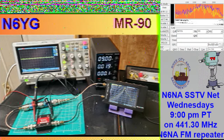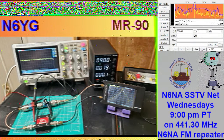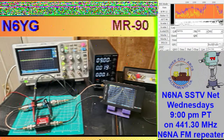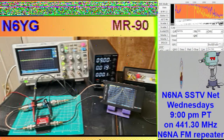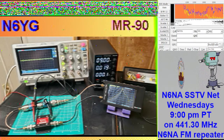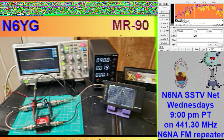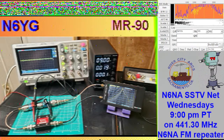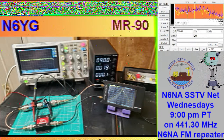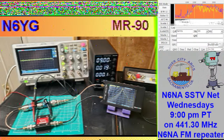And I picked up a couple of Dow-Key coaxial relays off of eBay, new old stock, that are good to almost a kilowatt. So I'm going to turn this into a transmit and receive preamplifier by putting 2 coaxial relays as bypasses on it. 12-volt relays. This operates off 12 volts. So you'll hook a sequencer up to it, and when you transmit, it'll bypass it.